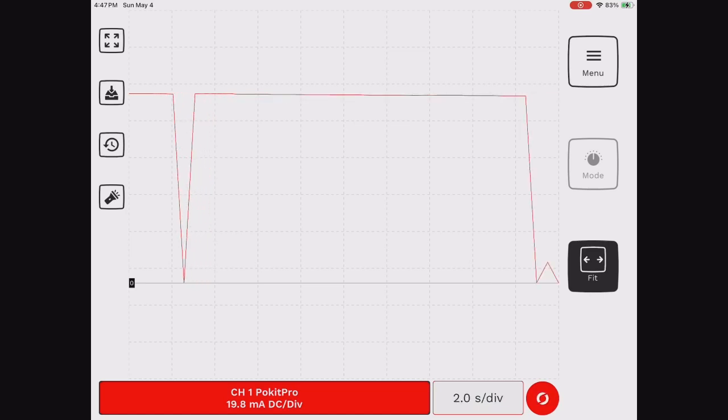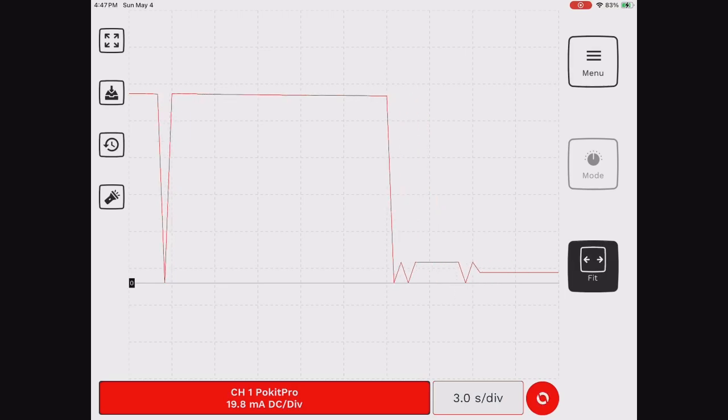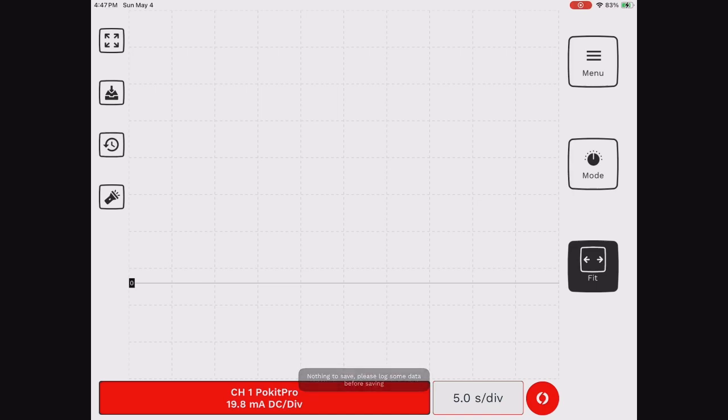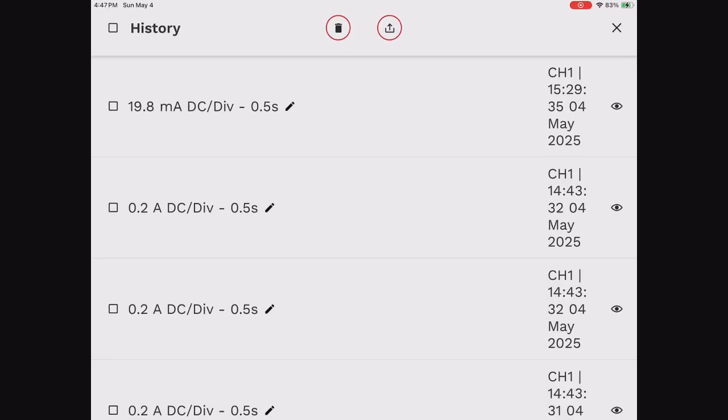Now I'm going to hit the 11 mil, and I'm going to hit the 5.7 mil. You can actually watch this thing, and it is logging it right now. It is actually recording all of this to the device. So you could hook this up, go to lunch, come back, see what it did. A lot of times what I would do. Or I'd go do something else that needed to be done. So the great thing about this is when you stop the logger, like I said, it did record it. And if you go into it, you can see it recorded it 19.8 milliamps DC at 0.5 second sampling rate.